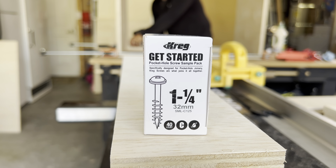Now we've got the first cabinet carcass built; we can move on to the second one. Now we can put together the kickers for the cabinets to sit on. It's a lot easier to position and level the kickers and place the cabinets on top of them than trying to position and level two whole cabinets with the kickers built in.